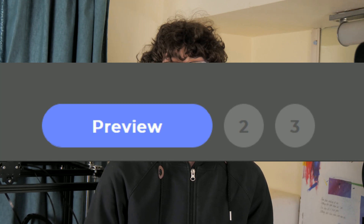After a few tries, the scanning process did seem decently simple. There were two modes you had to complete before you could move on to the actual scan, like a calibration run. What I would do was leave the first two modes empty, aside from registering the turntable, then when it came to the actual scanning, just scan what's there. It did take a few tries to get the hang of it, especially in handheld mode, but with a little bit of practice, anyone could do it.